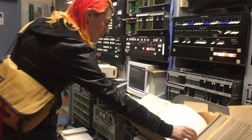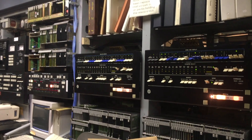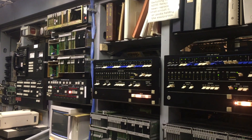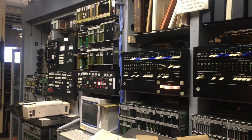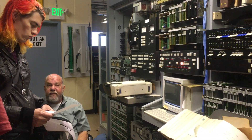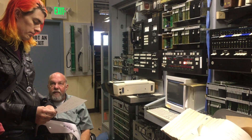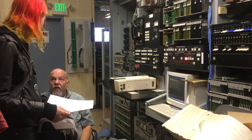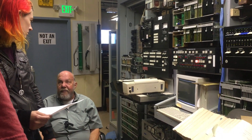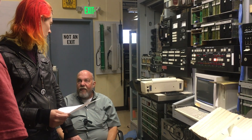Ed has things hanging over there in the new cubby, and one of the things that had to be put in there is Enable — make it the active processor — because it powers up as inactive, which is probably sound. These are the two MIS instructions: the first two. The third one is kicking the program timer. It took a lot of digging in the prints to find out Enable B and Enable A — couldn't find any documentation about it, had to trace it through the drawings.